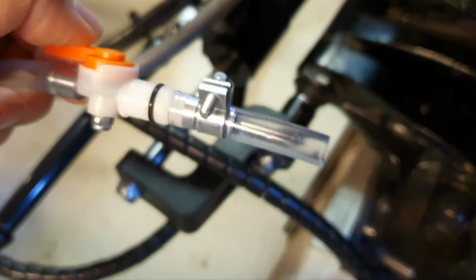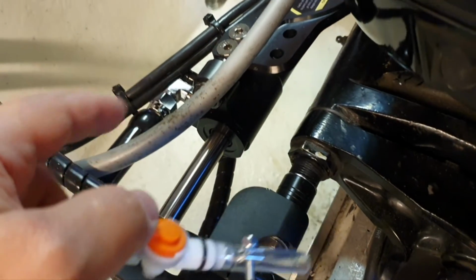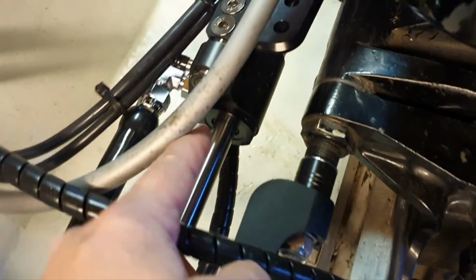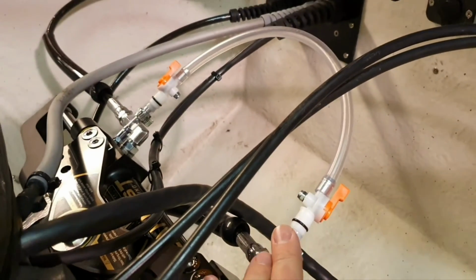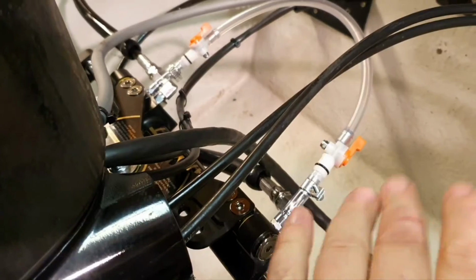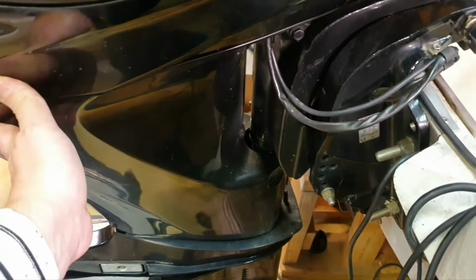By the way, it is not going to work here because with that method that I will show you later, when you have pressure here, it will pop out. In that case, you really need a quick release connection there. I didn't use this system this time, as you noticed. But you will find a lot of videos about this procedure. So you close this system and you just rotate the wheel there. You open these valves and you rotate the wheel. In this procedure you also need to put the outboard sometimes on the left, right, port, starboard side.